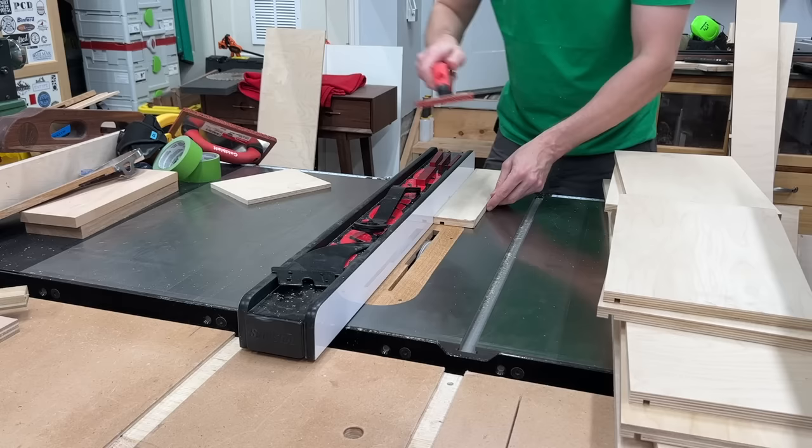I work the bottoms first in both directions, then spin it over on top of a little board with four screws sticking out. Since you never see the back of the drawer front, little pin holes are no big deal. I spray the front the same as the back, set that off to dry — did that with the two big panels and two small ones. Then for the top coat I'm using Benjamin Moore Scuff-X in Duxbury Gray, to match the same paint color I used on the mudroom.